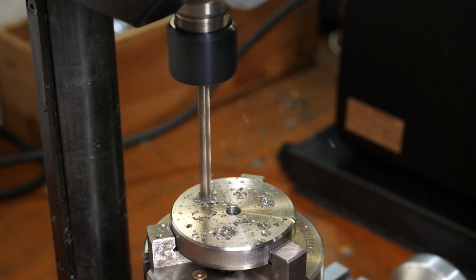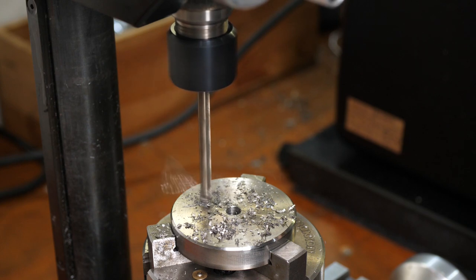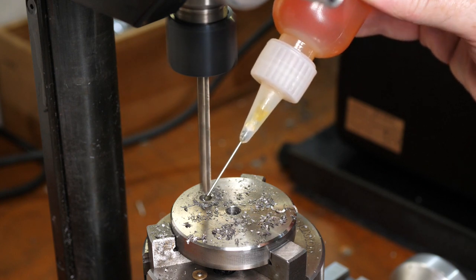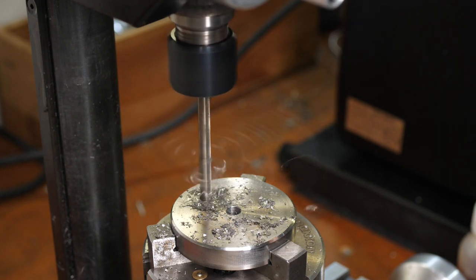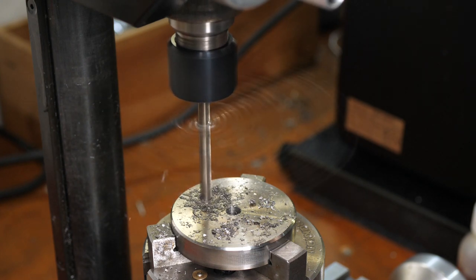The twist drill is a coated high-speed steel bit ground with a split web. This means it should have no trouble even in stainless steel without a pilot. Drilling worked best if there was a good consistent pressure applied; too little pressure and it started to rub and squeal.